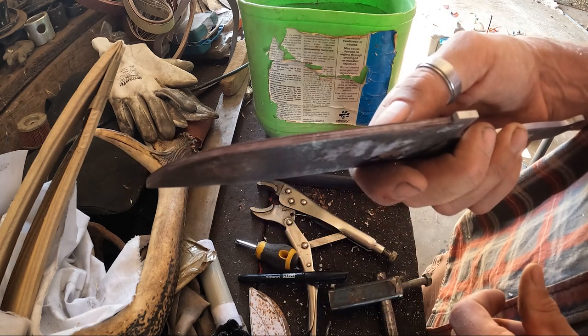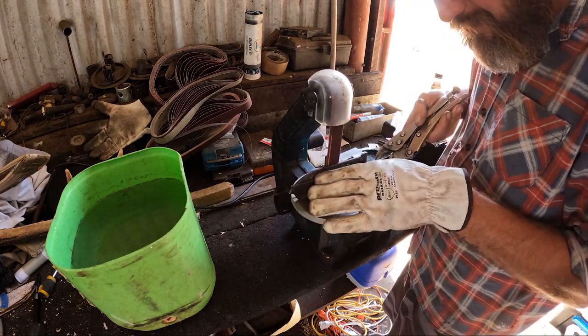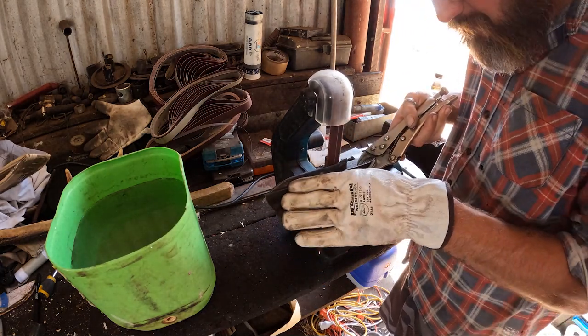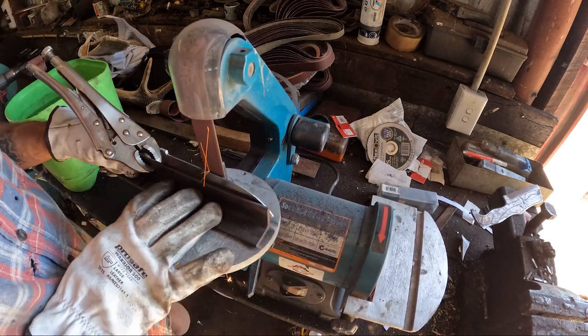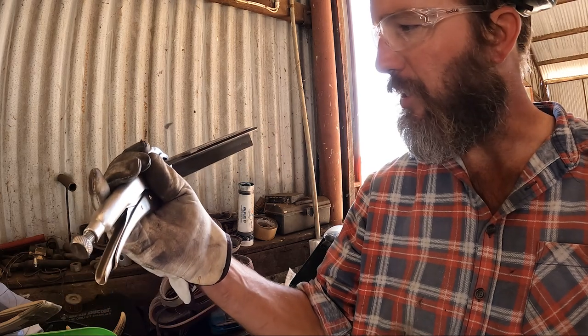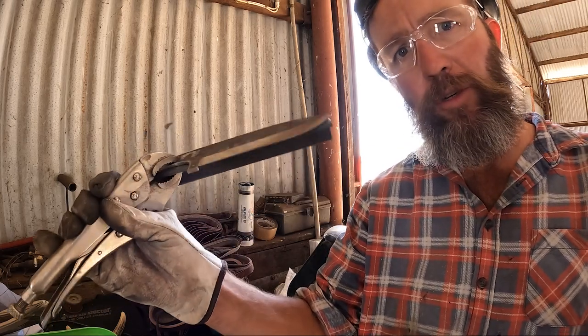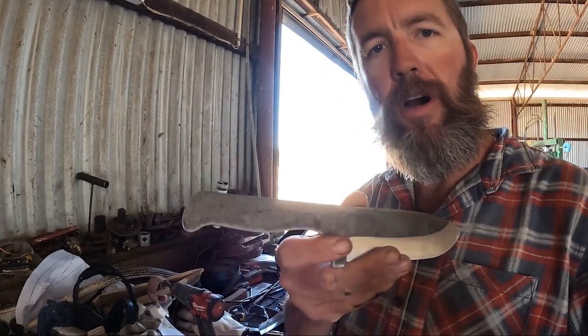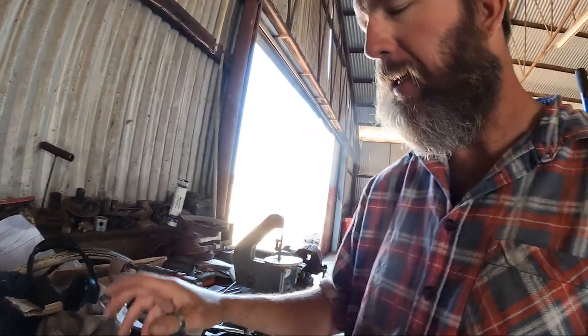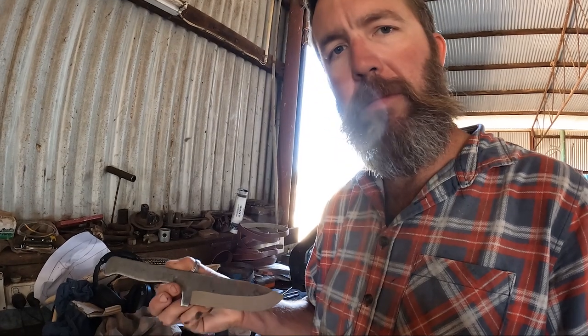I've left it there until I do the final grind once it's heat treated. Almost done — just a little bit more to go. There's about a mil on the edge here and I'll just take it down to just inside the lines I marked, about a quarter of a mil to go on each side. Today I'm just going to be drilling the holes for the handle pins and start getting the handle semi-sanded out, then hit these with a bit of sandpaper.